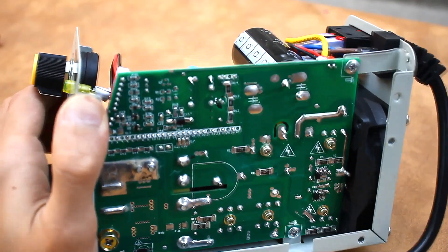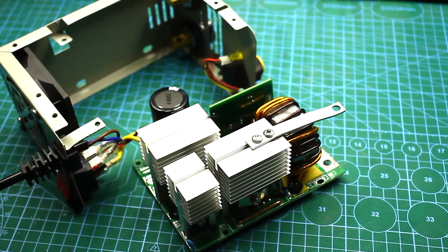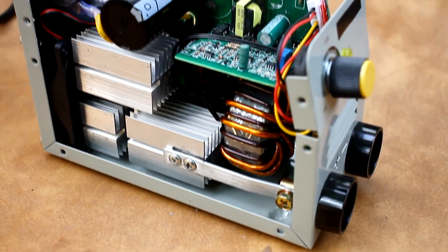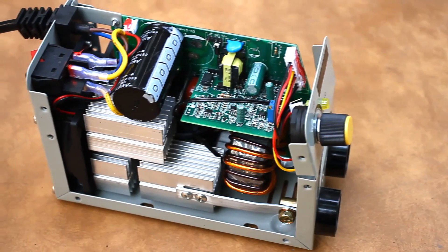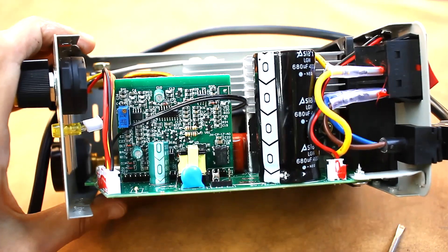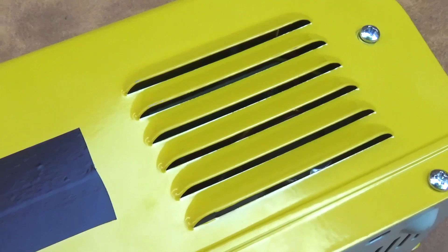Let's summarize what we've seen. In general, everything is well assembled. The half-bridge circuit is very good — it is certainly not a full bridge, but it works calmly and confidently. The bad thing is that there is no soft start, and in my opinion the standby source is rather weak, given that it supplies a rather powerful fan. But in general, it's not bad. Now let's go to the tests — we will weld later. First, let's connect the device to a ballast and check its real output characteristics.